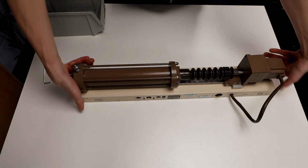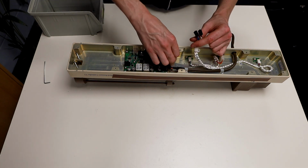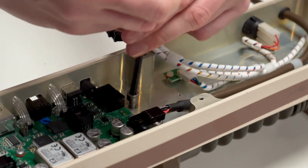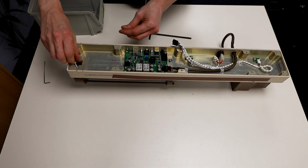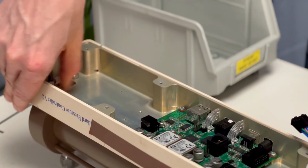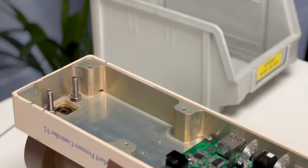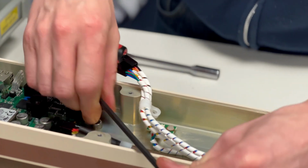Turn the controller upside down to start re-plugging the cables. Make sure to hold the base, barrel and motor together as you do this. Screw back in the bolts in the rear of the barrel using a 6mm Allen key. Using a 10mm deep socket, place the inner nuts back onto their bolts. Make sure all the nuts and bolts are tightly fitted using their relevant tools.